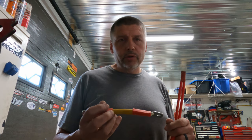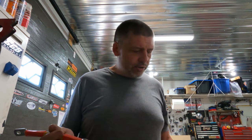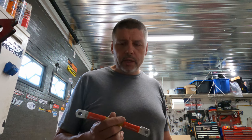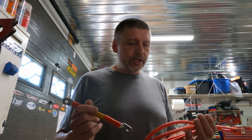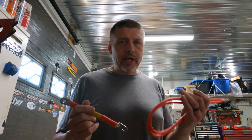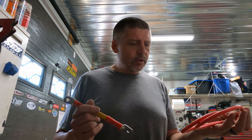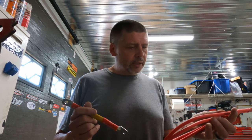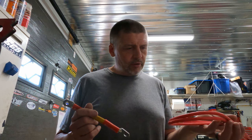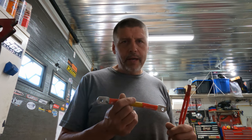You can never really go too big. There's no issue with a larger cable — it's going to run cooler and has less resistance. I have all this 1-0 welding cable which is good copper cable, though this might be copper clad aluminum — I'm not sure. If you go copper clad aluminum you need even bigger cable to carry your current. So I assume this is sufficient, but I'm just going to make better cables.